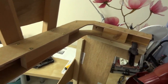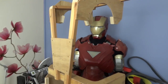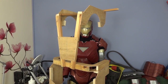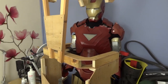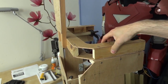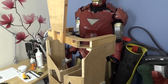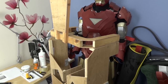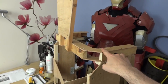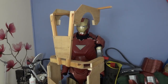Down here there's some space to put in more padding for the hips. This thing is actually sat too low — there's going to be a gap between the two so I can tilt side to side and twist. I need to come up with some flexible linkage between the legs and the top of this: probably rubber buffers, 3D printed in NinjaFlex, and also rubber bungee cords so the thighs are constrained at the hip joint but can flex all around while I rotate the torso and tip side to side.